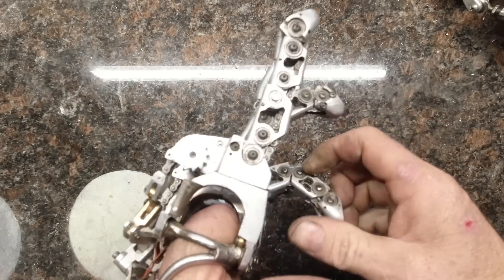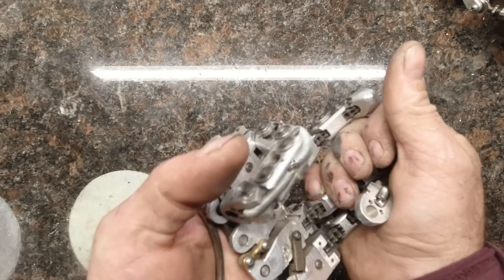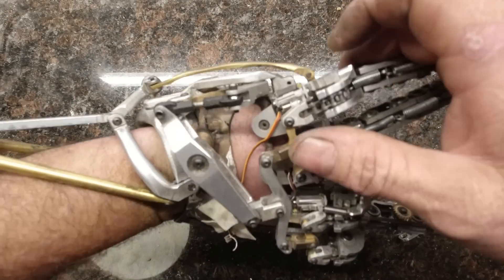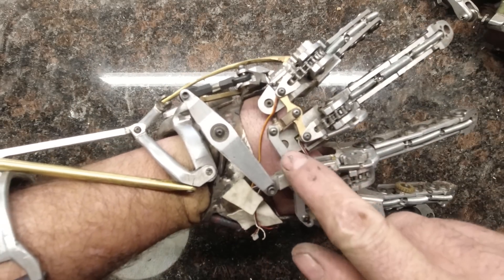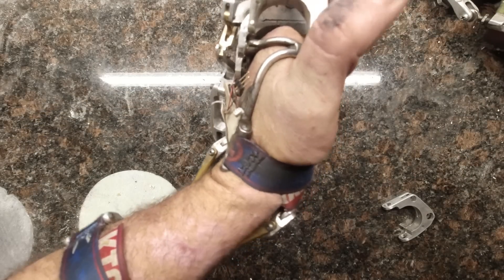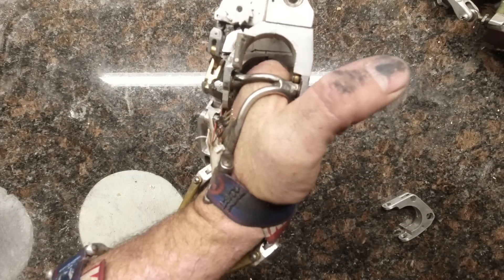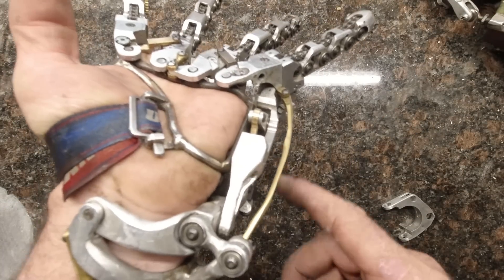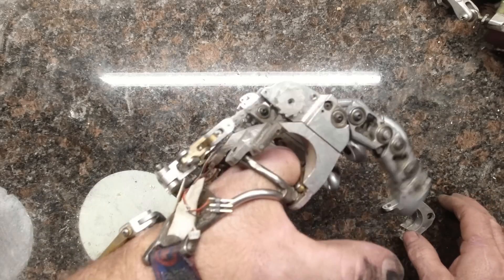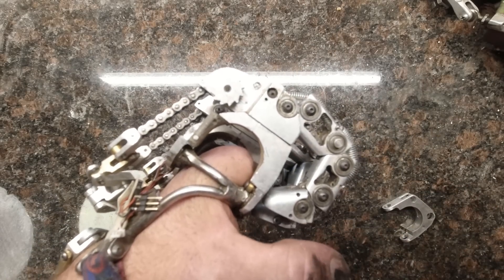The aluminum fingers may weigh a little more, but the fact that they are just that much more durable is really beneficial in the long run. Which brings me to my new hand. After a couple months of daily usage, I've managed to come up with a relatively short list of things that I'm planning on changing. I want a little more grip force, so that necessitates a change in the location of the fulcrums. I still want to have the total wrist travel be around 38 degrees, and I plan on being able to increase the force by increasing the lever arm length just a little bit.